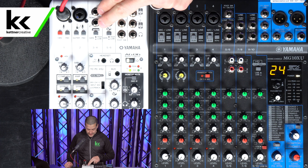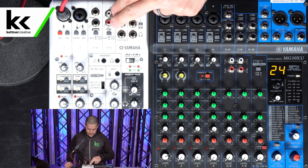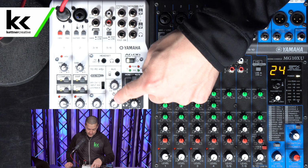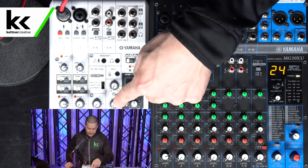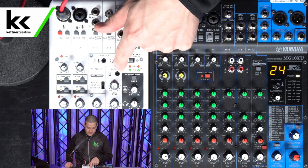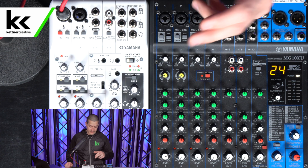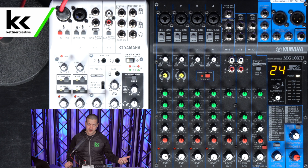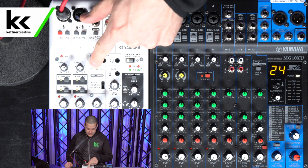Aside from that, you do get a 1/4-inch stereo line level input here and RCA. And then you can control both of those using the volume knobs there. There is a USB volume if you're using the USB loopback mode, and then there's a headphone jack input for an aux cable. This doesn't have its own volume control. You'd have to set that. Say you're using your phone as an input device, you'd have to set the volume on your phone for this channel.